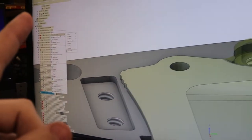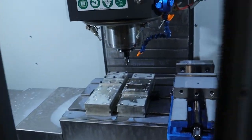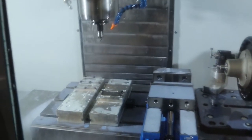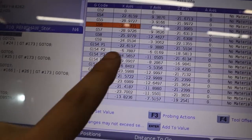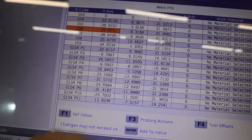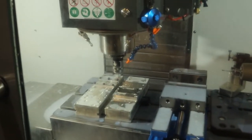I'm guessing the tip of that engraver is now not so good. That's also why it never updated the work coordinate system. Should have probably realized something was not correct — or I just think the Haas is that accurate, and I do not think it's that accurate. Let's try this again. I saw a number change — looks like a tenth on this one, a tenth up. This one changed a little bit but not much either. That's pretty close. Let's try our trace operation again.